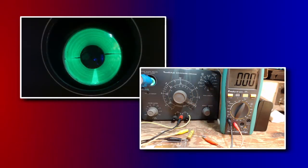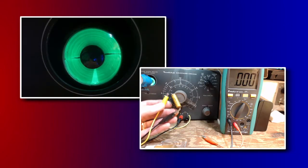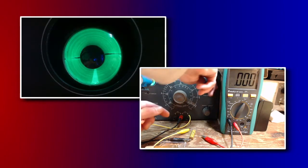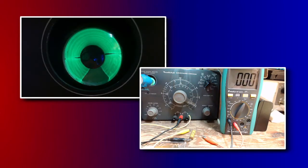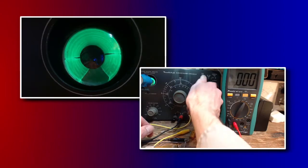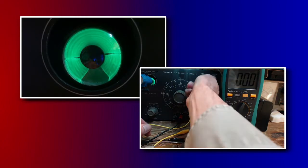Okay, this view might make things a little easier. I have to back up the cart a little bit and go back to the first two capacitors and do the leakage test, which I overlooked. So I have C1 connected again here, and we'll flip this over to leakage. And we'll start here. Now, see how fast that closed and opened? Means it's very good at 25 volts. 150. See, a little slower. Still good. 250.